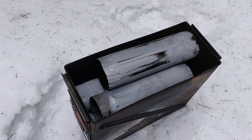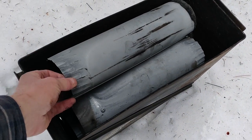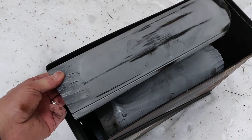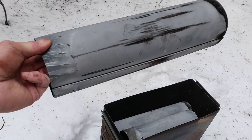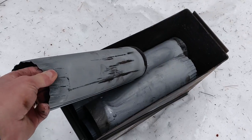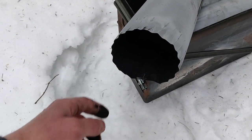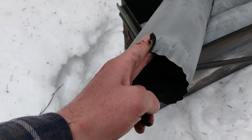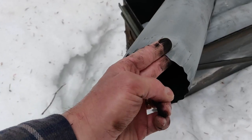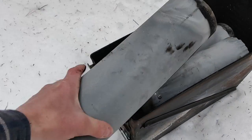I've got everything inside including the legs. The stove pipe is just galvanized pipe that you find at your local hardware store. What I did is cut it with tin snips so it fits inside the box. The pieces that I cut I actually re-crimped so I can use them — I just took some needle nose pliers, went in, and gave it a little twist all the way around. That way I wasn't wasting any pipe.